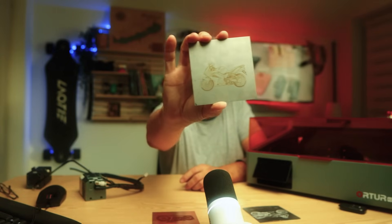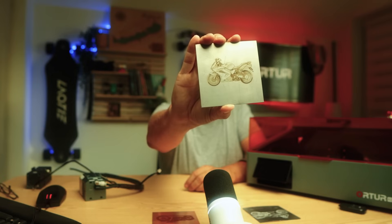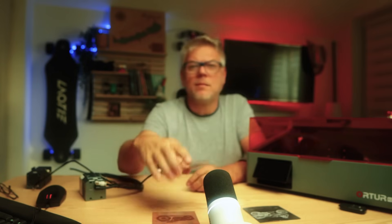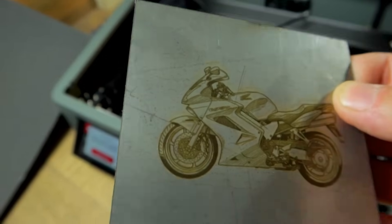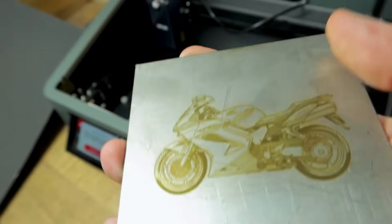With steel, it's a completely different story. Steel absorbs light beautifully, and it's very important to mention that you can experiment a lot with it — depending on how strong you set the laser power, you can change the color of the engraving. The stronger you set it, the bluer it gets; the weaker, the grayer it becomes; and in the middle, it takes on a brownish shade. With lower power the engraving turned out a bit grayer, while with higher power it became more blackish-brown. The inscriptions are perfectly readable, you can see the tiny ventilation holes on the brake discs — the engraving on steel turned out absolutely professional.